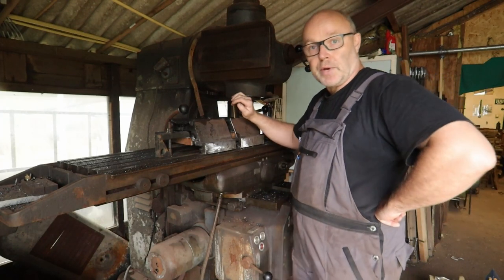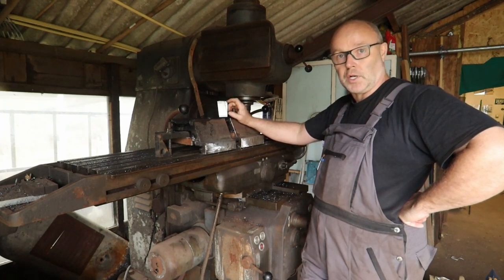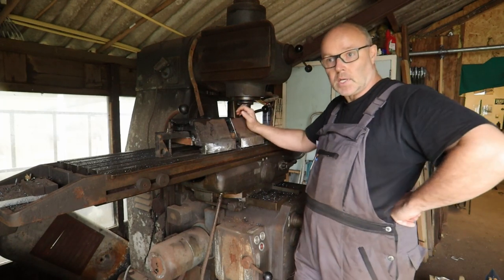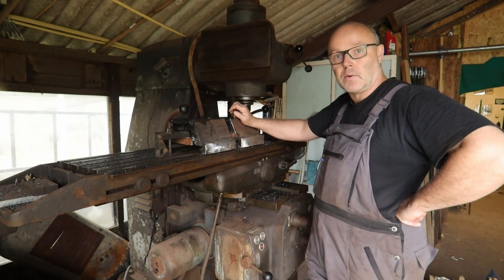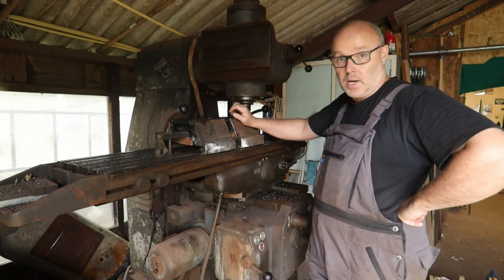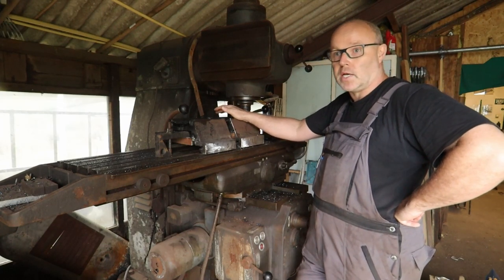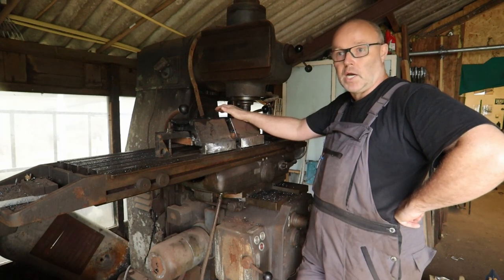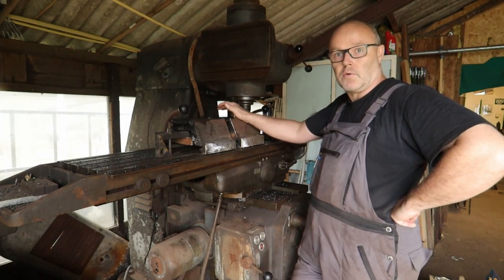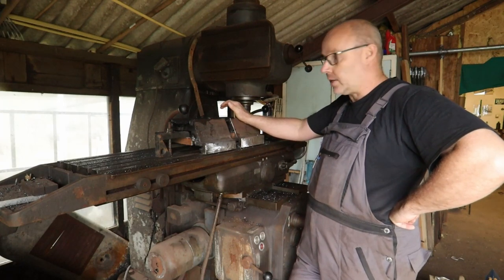And to repair the machine, it has 2 drive rolls with rubber on them for driving the milling head. One seems to be okay and one needed to be replaced. So I made a new one, but now the other one is breaking down, so hopefully I can finish milling this. At least I will try today, and then maybe tonight I will take it off and cast another one that can cure during the night, and then put it in the oven tomorrow for finish curing. So hopefully I will only lose like a day.